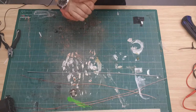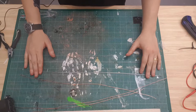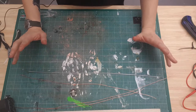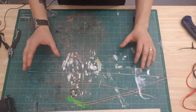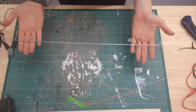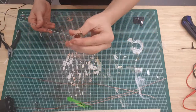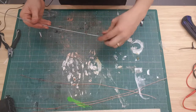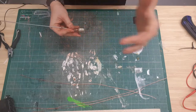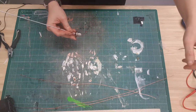Okay, hello. I'm going to be making a VHF quarter wave ground plane antenna. That sounds like a lot of fancy words, and it is. Essentially, all it is, is an antenna piece coming off a base. In this case, I'm using one of these connectors. And it's going to have a couple of radials, which are just other bits of wire that come off